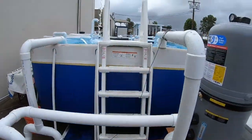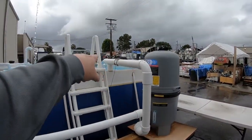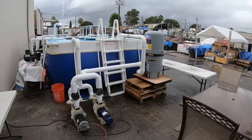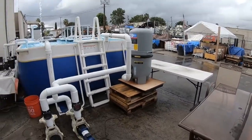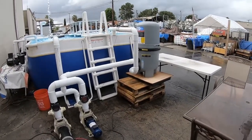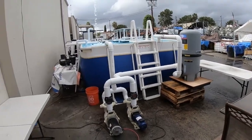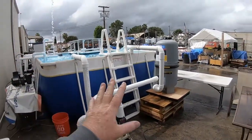You can't even hear it — it's that quiet and silent. We have our suction going right through a cartridge filter back into the pool. This is how I plumb it in. If you're wondering why I have the filter lifted, ask yourself why aren't you doing it — less back pressure, the better. Less PVC twists and turns is what you should be achieving. Water's not going to come back through because we have check valves. I use all sweep elbows here.